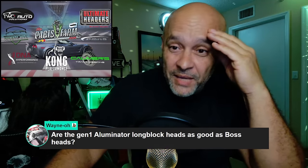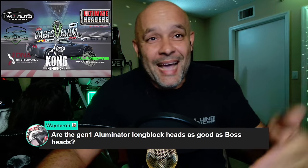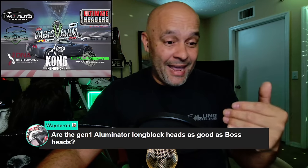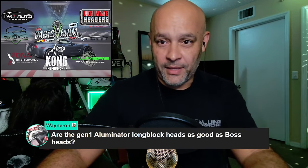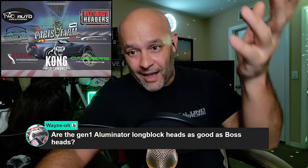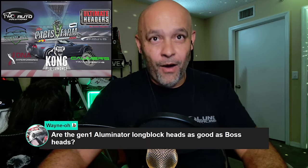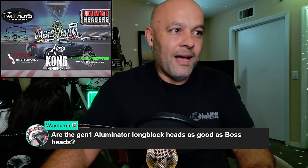Like, out of all people, to get, I don't want to say botched, because I don't know what happened. But at the end of the day, I wanted to see for myself, what am I dealing with here? And after seeing oil in most of the intake valves, a nick on number one piston, misplaced cam caps, I went, oh my God, what else could be wrong? I'm blown away.